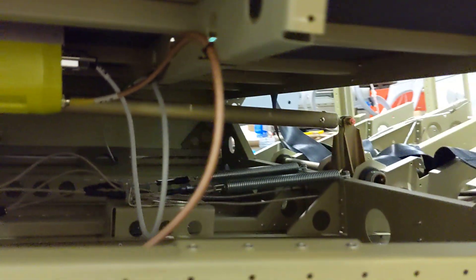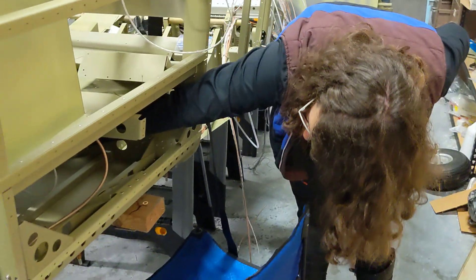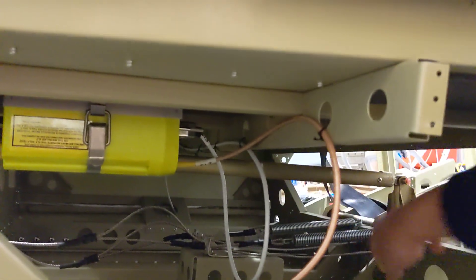Note that the ELT is shielded from the rocket exhaust — that would be parachute rocket exhaust right here. It's shielded by this rib. Here's where the rocket exhaust would go. We've also been careful to route the ELT wire away from the push rod right there.